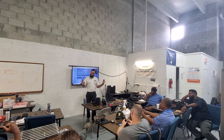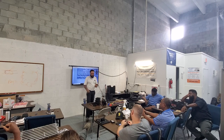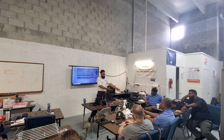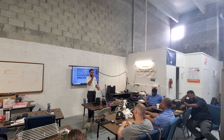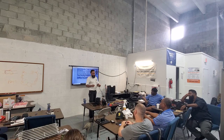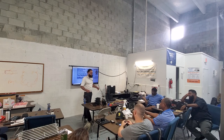Okay, let's take a step back and think about where we are in this simulation. We've said we let the nitrogen out. We didn't pull the vacuum because he said that's not necessary since we already did the sweep. So now that we've done the sweep, we know we don't have any leaks. Can we add Freon, yes or no? No. Why not? You have oxygen. So what do we have to do then?